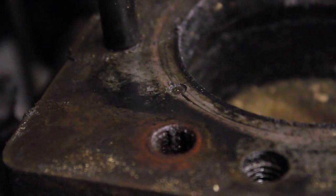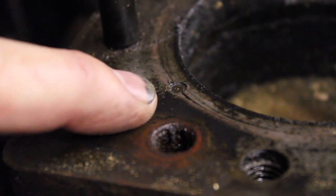The trouble is they're stopping everything - one's on the upstroke, one's on the downstroke, so they're stopping the crank moving in any direction. We've even tried knocking the sleeves out but there's no movement. There's a bit of an issue though - we can see a little dowel at the top of the liner and at this point we're not 100% sure what that dowel is doing, whether it's locking the liner in or something else. Something's not right.